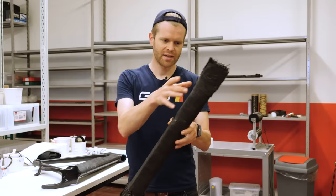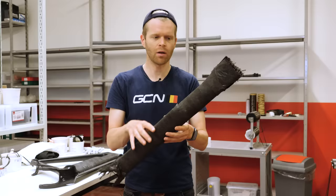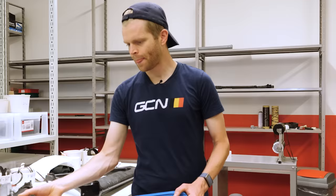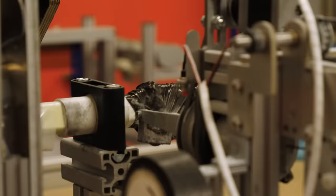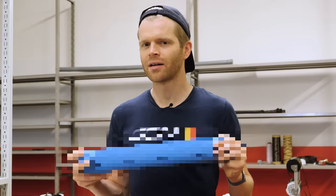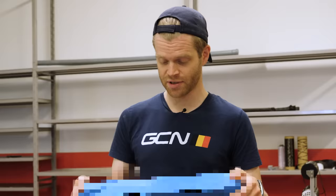While it's being knitted, UV light is periodically shone on the frame, which activates the special ingredient and helps stick the carbon together. Without this, it would just be a loose pile of cloth — it wouldn't hold its shape and would just fall to bits. The tube shapes are wrapped around specific mandrels to give them their shape, and this brings a key challenge: mandrel removal. How do you remove the mandrel from inside the wrapped carbon? On a normal filament winding process with a consistent round tube, that's relatively easy. Here, it's a significant engineering hurdle. However, 3T has worked out a clever way to do it — they've showed me, but I'm sworn to secrecy as it's top secret.